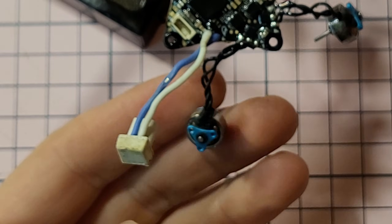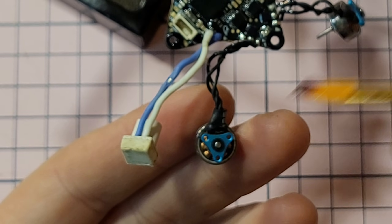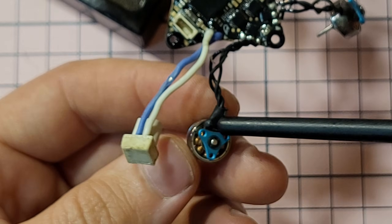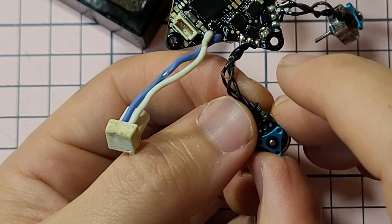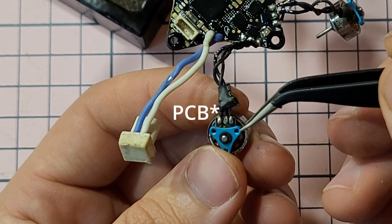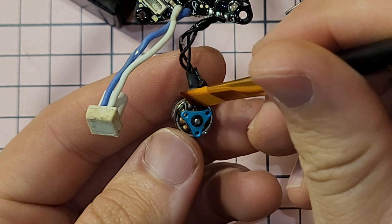I've seen waterproofing being done only on the board, but to fully waterproof it you also want to waterproof the motors, because you have the connection on the motors and if it gets in the water the motor won't know what to do. So we probably have to take the shrinking tube out of the way — I'm gonna pull this heat shrink tube back, and I'm gonna do this for each one of them. You can see this is the PCB on the motor — just a little tiny bit — and I'm gonna brush it.